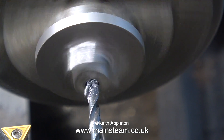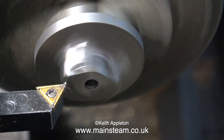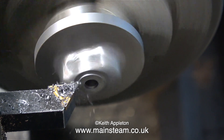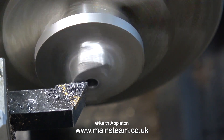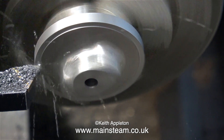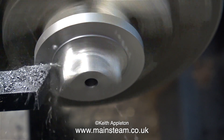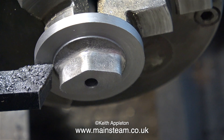The rear part of this casting is running very true; the front part isn't, because that's unmachined. The best way to approach this side of the machining job is to take a light facing cut across the front, then centre drill the front part, then drill all the way through with an 11/64th drill, which is one imperial size under 3/16ths of an inch. Then I would use a 3/16ths of an inch reamer to get a really good finish in the hole for the piston rod. You need to be careful here — the casting is only held in the chuck by that extension piece, so shallow cuts are the order of the day, and you don't want to go too far towards the stuffing box and hit that.